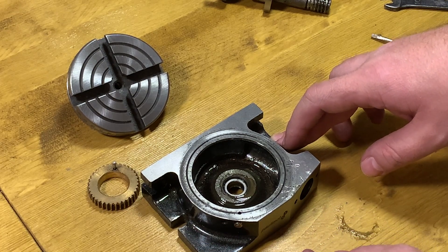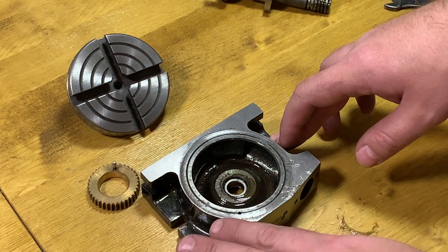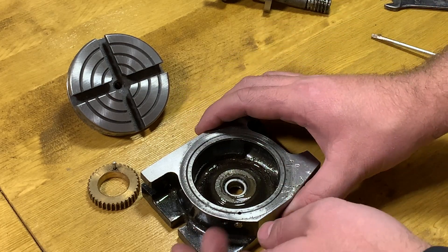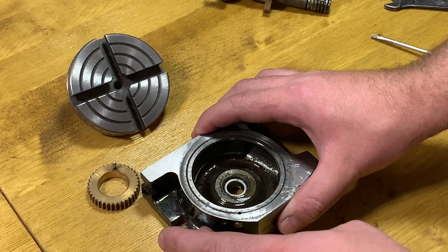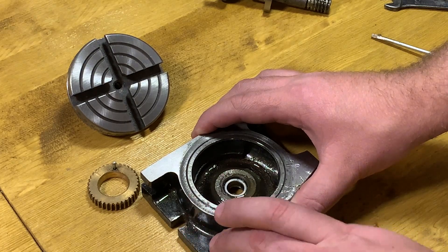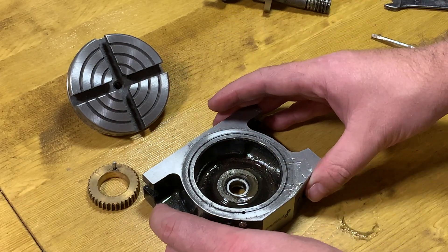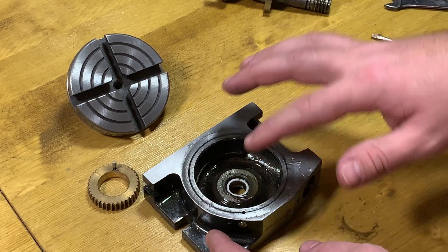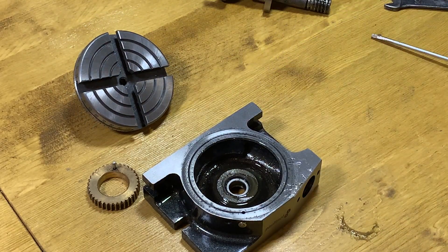There are several ways I could do that. I need to make some post on which this clamp will be mounted. I will use the same hole, and I will also need to cut a little bit to have a clean surface here and maybe here. So just a piece of metal mounted here and then a clamp from the top to this piece. Let's go with a bit of milling.